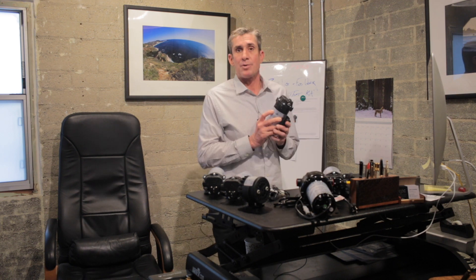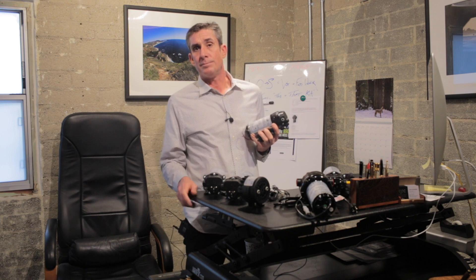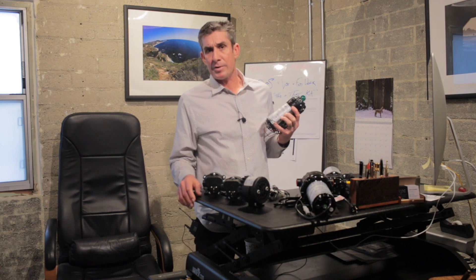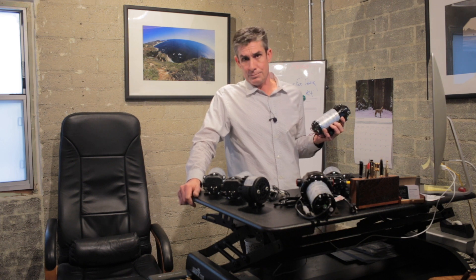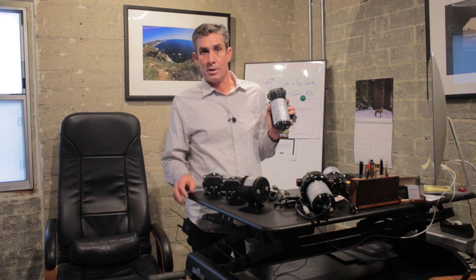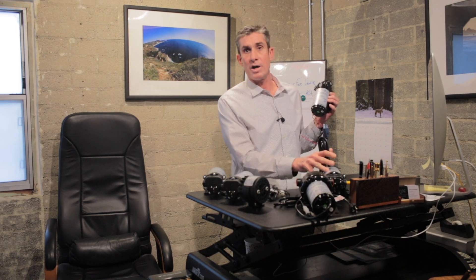With these pumps you have a set pressure and a set flow rate. So you want to look at your application and say: my ice maker needs a quarter gallon a minute, my drinking water spigot needs half a gallon a minute, and my coffee brewer needs half a gallon a minute. That whole system would demand one and a quarter gallons per minute if everything was on at the same time. They come in quarter inch and three-eighths, and are available hardwired or tail-wired, so it's plug and play.